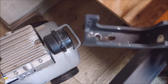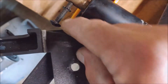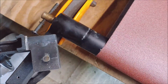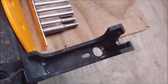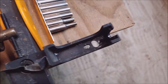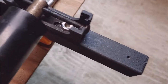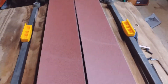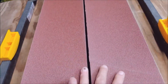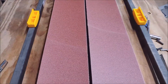I found it. I poked a hole in it right there. We'll bolt it down where it's currently bolted, and then we can get away with the thin-walled thread over here with the other one. I missed on this one but hogged it out good enough — it's just a belt sander. Get a load of that. All I've done is flip those two rollers around, drill two holes. I got them on there — there's no back plane yet, but they're tensioned. Let's see if we can track it.